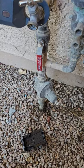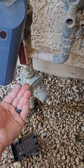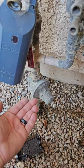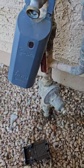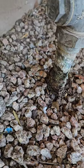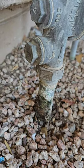This is our main water shutoff valve, connected right above a pressure regulator. This pressure regulator is actually making this a closed system — there's a one-way valve that won't allow water to go back down the pipe. With that check valve in there, we really need to see a pressure tank inside by the water heater to allow for expansion and contraction of water inside the pipes. But it is leaking — we've had previous leaks, some corrosion built up. These copper fittings need to be looked at, possibly repaired or replaced.